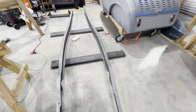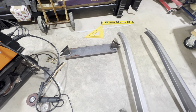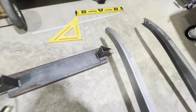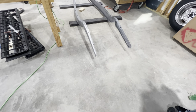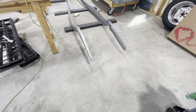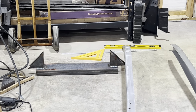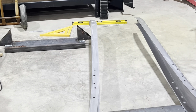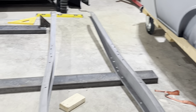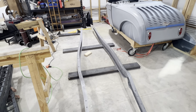I just finished welding up the first cross member. I'm going to mark two inches up off the side of these angles here because the bottom of the rails are supposed to be two inches up — so these middle ones are going to be on the floor. There's a measurement that goes with the very back of it, it's two and a something. If I get really froggy, I might put some blocks in on that cross member right at two, so the fronts will just sit right on them — that would be very stable. Then use my level and level up everything, just put shims underneath each one, make sure they're even and straight side to side. That's how I'm going to build my frame.